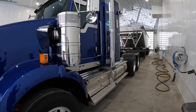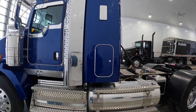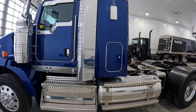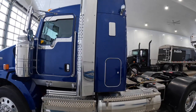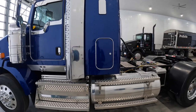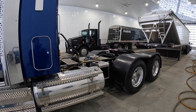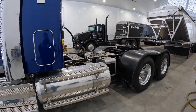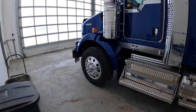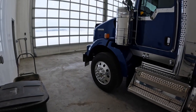I went with a small bunk. Guys can still sleep in there, but honestly the bigger the bunk the more guys will hoard stuff in there. A smaller bunk means less space for things that don't need to be in there, and it also means you need less frame length for trailer clearance — a shorter frame equals less weight and better cornering going into fields or approaches.